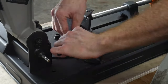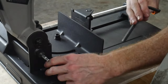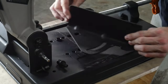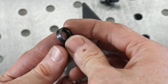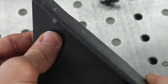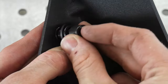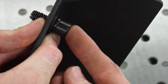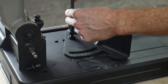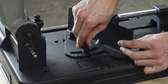I found the angle fence here fairly easy to use and straightforward — it easily indexes between 45 and 90 degrees quickly. You can also move the fence into three different locations depending on the size of the stock you are cutting. If you're cutting larger stock, especially at 45-degree angles, you'll have to move the fence towards you. I found this bushing on the pivot point of the fence to be a nice feature — it allows you to tighten the pivot bolt but still be able to move the fence freely, which a lot of older saws I've used did not have.